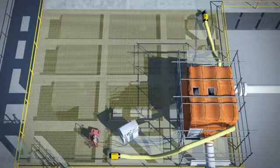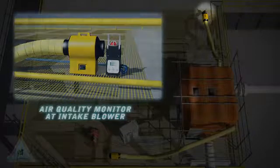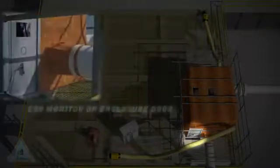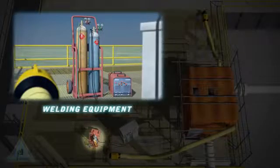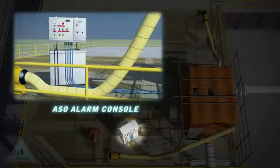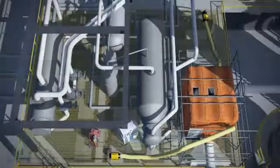Safety devices are added, starting with a state-of-the-art air quality monitor to detect and signal oxygen and explosive limits at the ventilation intake and inside the enclosure. A differential pressure sensor is installed on the access door. Welding or cutting equipment is integrated with all safety devices in the ASO alarm console. A loss of pressure, compromised air quality, or facility emergency will disable all hot work.